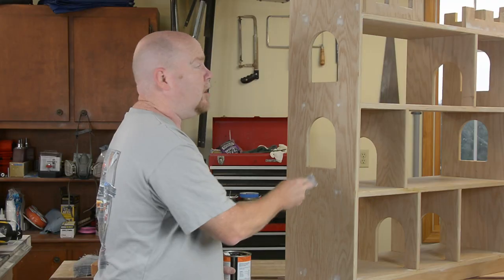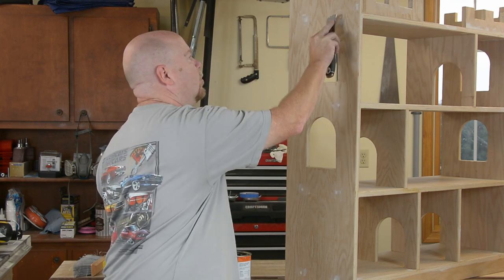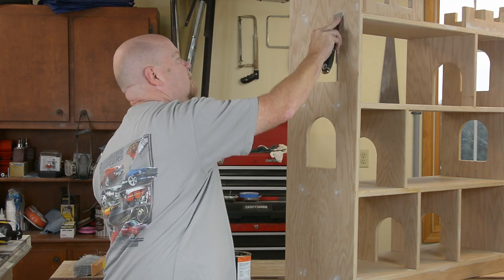My skirt was just a titch too wide — it was making the case sit wobbly, but it wasn't wide enough to take back to the table saw. Hand planes and plywood don't get along real well, but it worked out fine. With basic construction done it's back to roundover duty — I busted out the trim router with the same one-eighth inch roundover bit, running around the inside and outside of the entire case, even around the tops of the battlements, to make absolutely sure there are no splinters or sharp places a kid could grab.